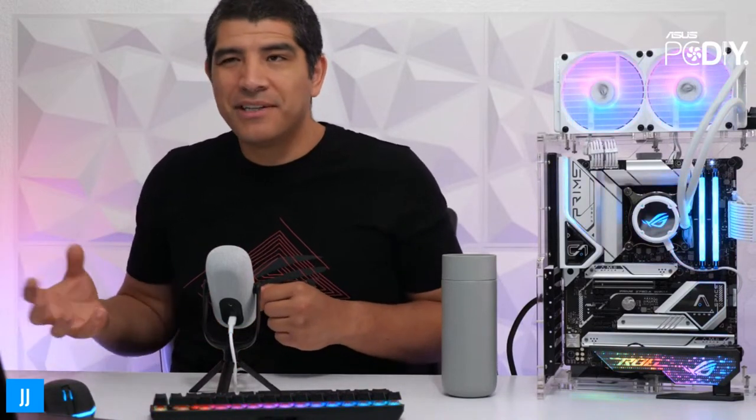I would say though that an LCD does have some advantages compared to OLED when you talk about things like the consistency of the subpixel rendering. It's sharper, it's clearer, you don't have to worry about things like burn-in. The color gamut performance can actually be even better on an LCD than on an OLED, but of course the contrast and the self-emissive technology is really the key benefit, along with the pixel response. Pixel response is going to be even faster on an OLED than on an LCD. But again, we have OLED solutions. We have 13-inch OLEDs, 15-inch, 27-inch, 32-inch, 42 and 48. So we have a full comprehensive lineup of OLED solutions as well, okay?